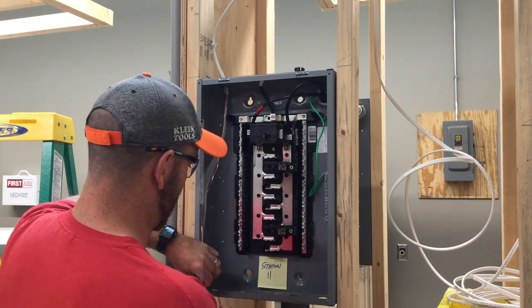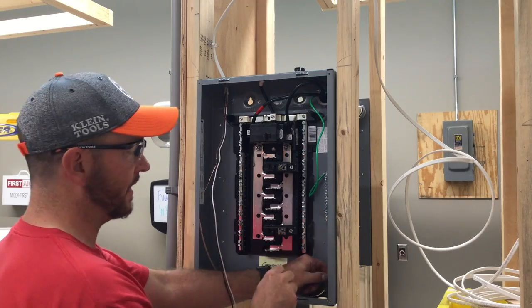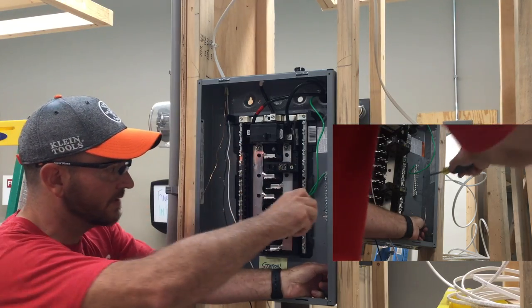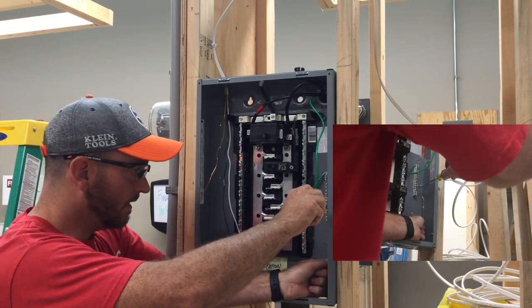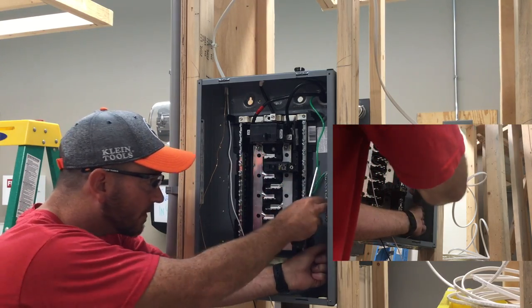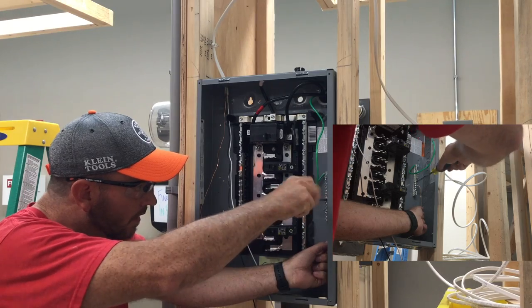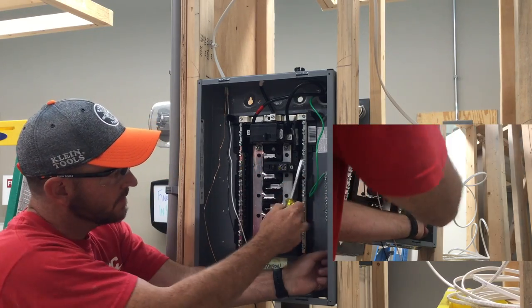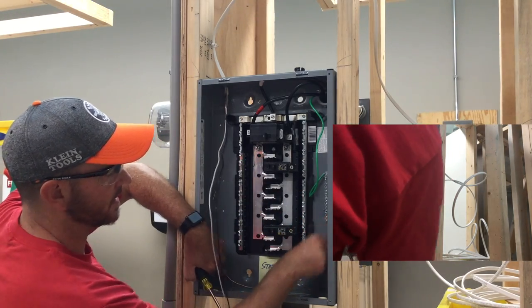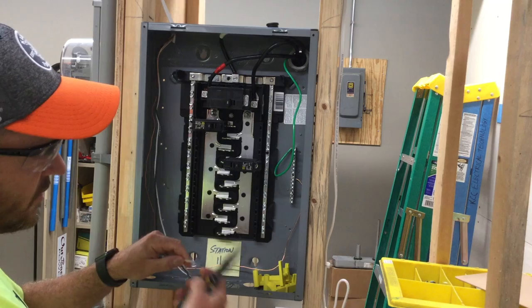I like to start with the ground. Ours is attached to the side over here because it is a sub panel. Using my number two bit — you can use a flathead screwdriver as long as it fits — I'm going to put it in the middle since I'm not sure where the day is going to take me, so I can leave a little bit hanging out. Tuck it in, make it look nice, and the ground is connected.